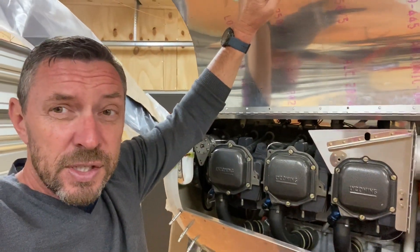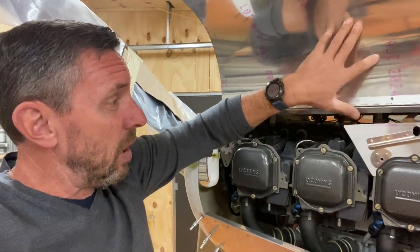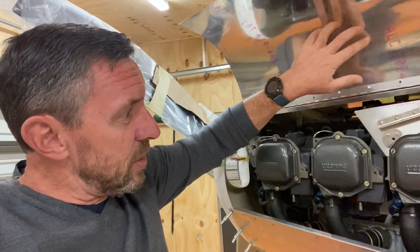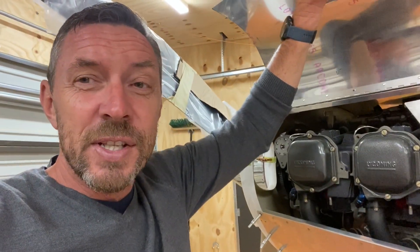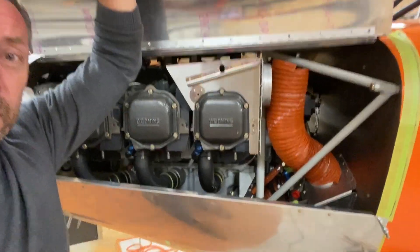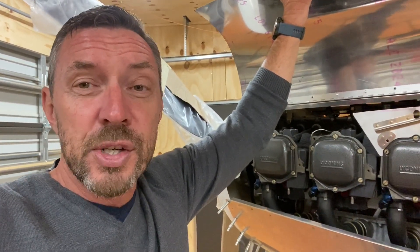One interesting aspect of the design is that air comes in through the front intakes on top of the cylinders and creates a high pressure area up here. Once the baffles and rubber seals are all in place they'll seal against the top cowling, and ideally you want a low pressure area down below — we'll test that out during test flying. I think an advantage of having the oil cooler down low is that it's very close to the outlet, so it should draw that warm air through the oil cooler and discharge it straight overboard into the low pressure area.